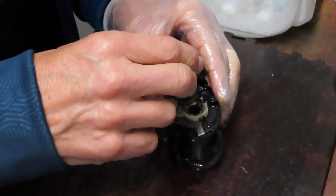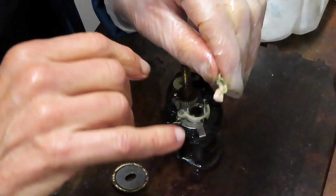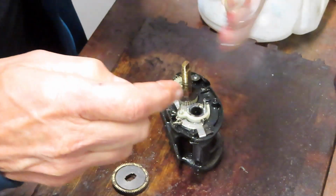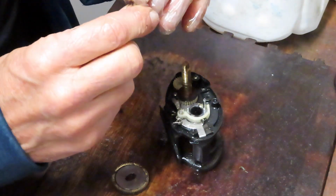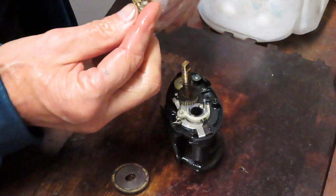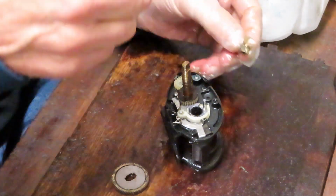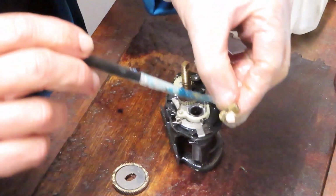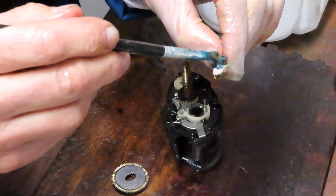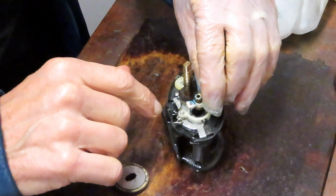All right, here's what we've serviced. That goes on next, but I'm going to do two things first. I'm going to grab that yoke. The yoke has 2 points on it. It has an angular piece, and that's what's going to ride up and down. So that's the back of the yoke. It's going to sit like this, and then the spool side of the gear faces inward. So this is how your gear lines up. And what I want to do now is get a good amount of grease on that gear, on both sides, all around it. Get it into that little groove so that it's on the carrier. Angle side down onto the posts.